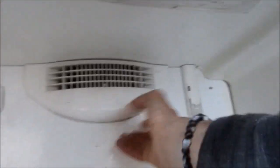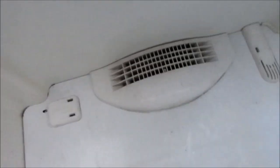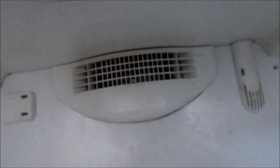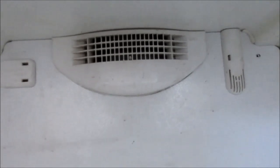Okay, got it pretty much back together. Here's this little clip in the center — if you just push up and pull out on that, that's how that thing comes out. I've broken a few just trying to learn how to do that. Little clip in the middle — just push it up, and you don't have to push it up too far, just less than a quarter of an inch.